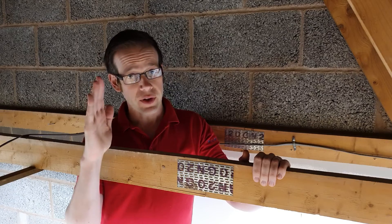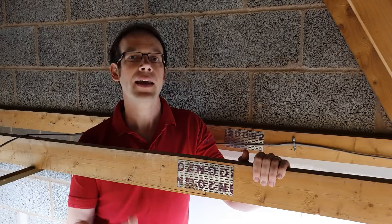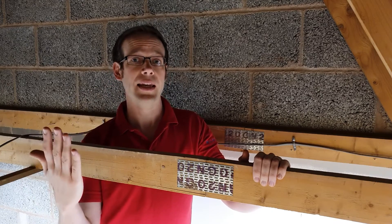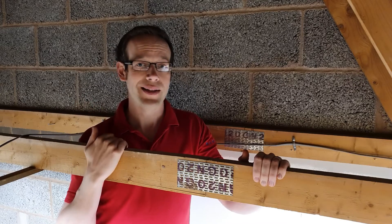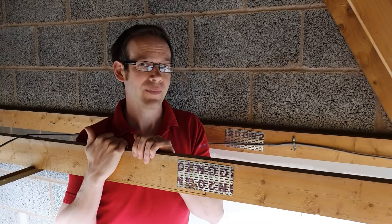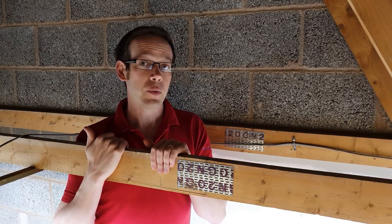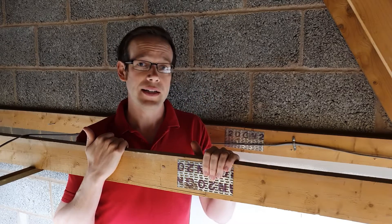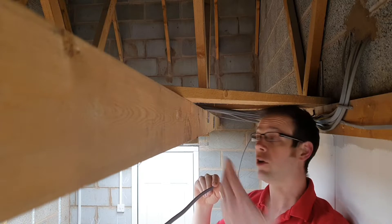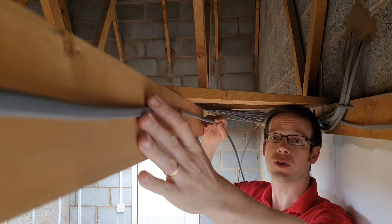The second obstacle is where we've got the cable coming down the wall inside a piece of plastic trunking. If a fire breaks out, the trunking is going to melt and the cable is going to fall off the wall, potentially ready to entangle a firefighter. The third area — a controversial one — is the existing cables that are already here. We're going to tackle these one at a time. I've got my cable laid out along the route and it's just a matter of tacking it in place and making sure it's properly supported.